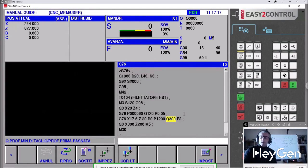If you're making a single piece, the fixed cycle will be your lifeline, or even for small batches, because programming time becomes a significant factor in cost estimation. But if you're making 100,000 pieces, it's worth it to have a program that's 100 lines longer, but saves 3 seconds at the end of the cycle, especially when you're producing 100,000 identical products. Time, money, and production are key.